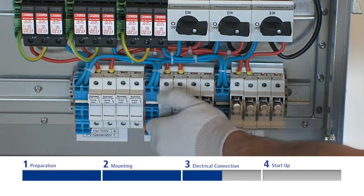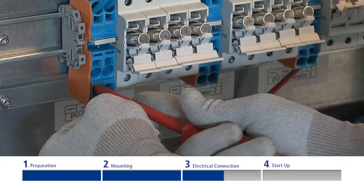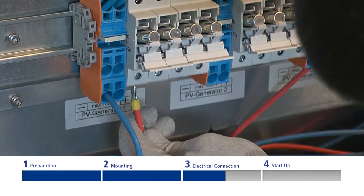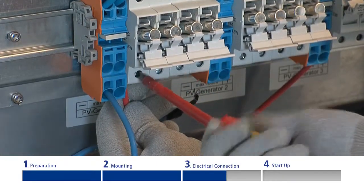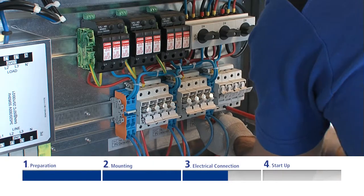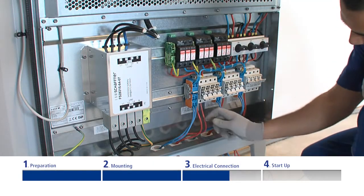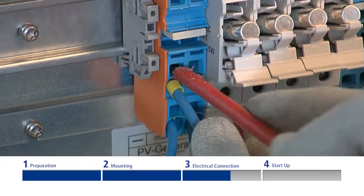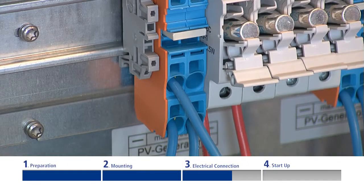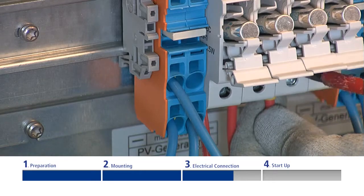Open the line fuses and attach the cable ends onto the DC connectors. Check that the cables are connected properly and firmly. Secure the cable fittings which are not in use with protective caps. Please take into consideration that the inverter's three MPP trackers can be wired asymmetrically. Please refer to the extensive information on this in the manual.